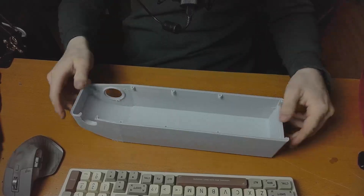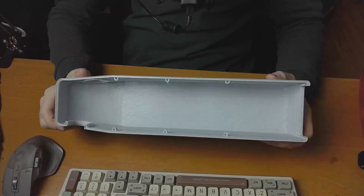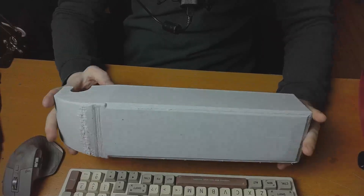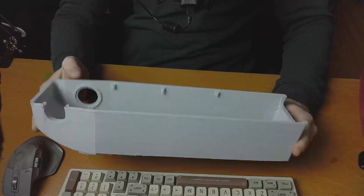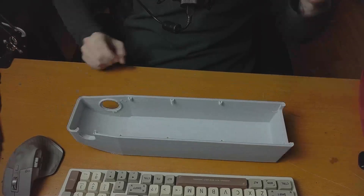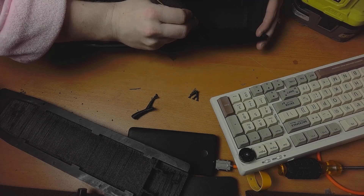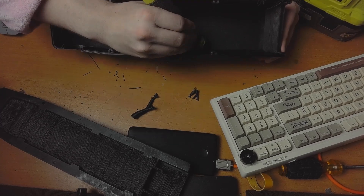This was my first revision. I realized as I continued designing that I would have to make this shell in two parts, and I really wanted to minimize the number of separate parts to print to make it more accessible. The idea was to just prove that I could print this at all, and that's what this first PLA version was. After many revisions — I believe five rounds of printing, testing, and resizing total — I came upon the design you're seeing here.